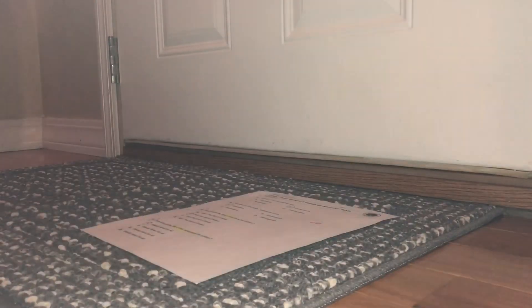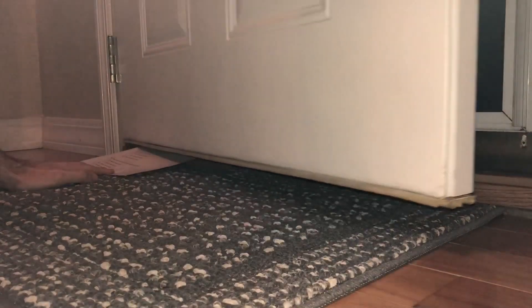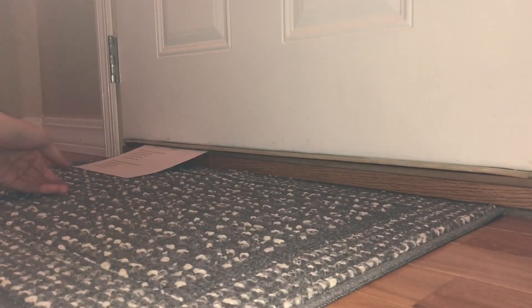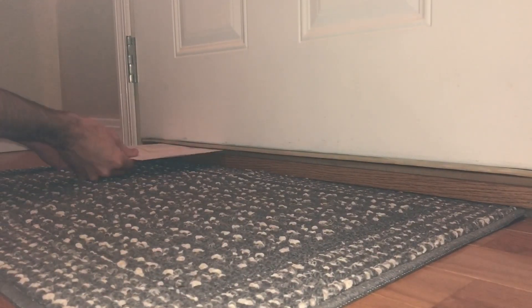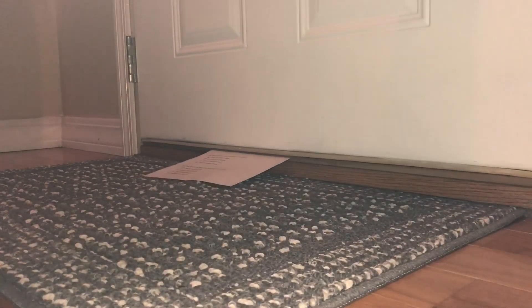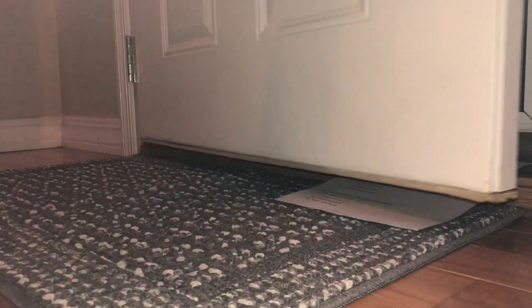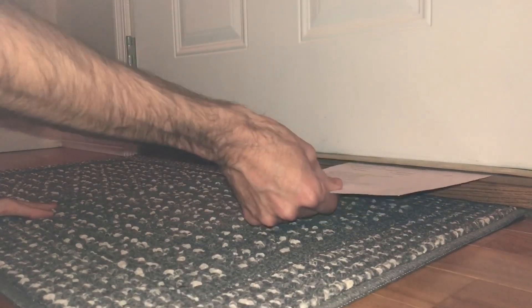So I've just got a piece of paper — my son's homework. Good job, kid. I'm gonna open the door and check all the way across this sill plate. I'll slide it in close to the hinge side and close the door. When I pull this out, I just want it to have some pressure — I don't want it to tear. It's pretty snug there, probably about good. Do the same right here where the low spot was — it's pulling out easier here, so I may want to adjust that up a little bit more. And finally I can almost push it back in that way, so I definitely need to come up over here.